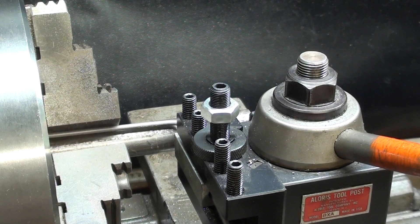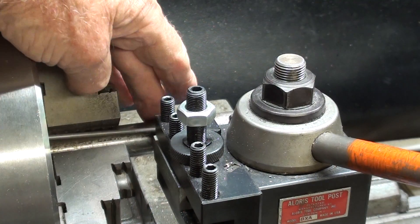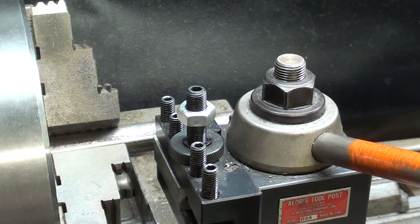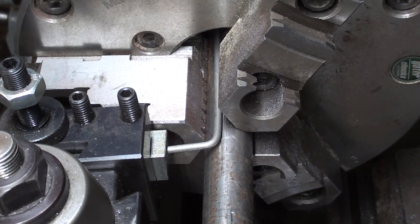This is the same as winding a spring, and remember stainless steel is rather springy compared to mild steel, so the diameter of the ring will be undetermined. Sometimes you have to use trial and error if you want an accurately sized ring. The machine is all ready to go — the half nut is engaged and it's going to take right off at 8 threads per inch in reverse slow speed. It's better to have a lathe that has a clutch so you can turn it off quickly. Don't do this — it's dangerous. Alright, let's go.